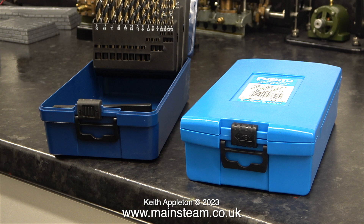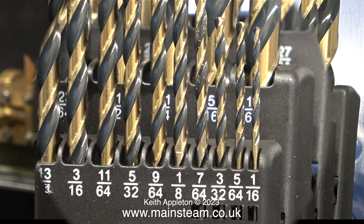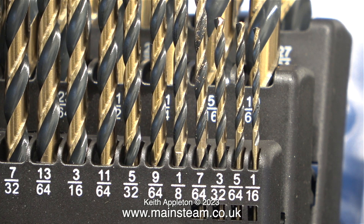On screen there are two boxes of twist drills. One is an imperial set on the left and on the right is a metric set. I have a much better set of metric drills in my workshop — this metric drill set is a jobbers drill set and it doesn't contain enough twist drills, just the common sizes, which is okay for general work. The set on the left contains all the sizes that I need. It's an imperial set, so you may be thinking: imperial in 2023? Well yes — I work in imperial usually for two reasons: one is that's what I was taught at school, and the other is that all the parts I normally work on are imperial sizes.